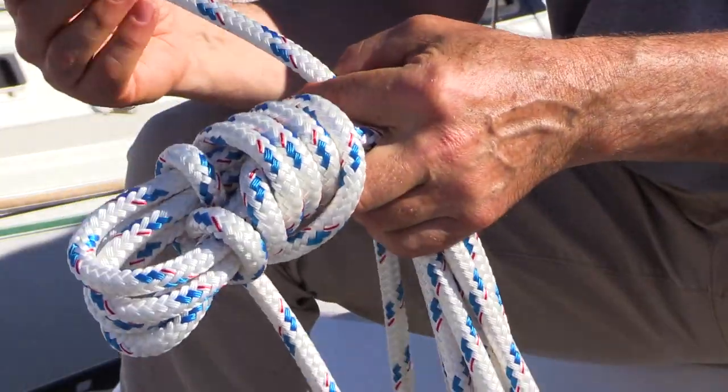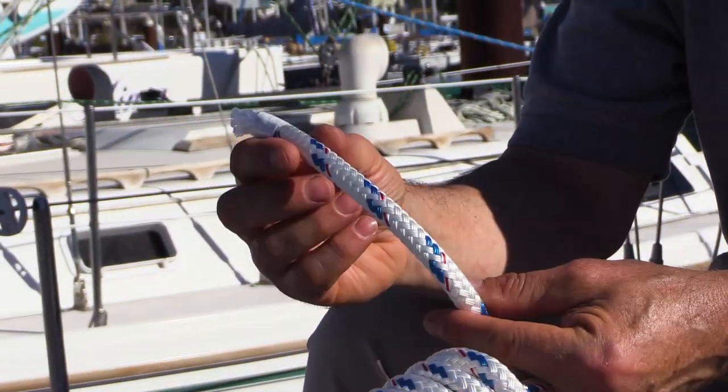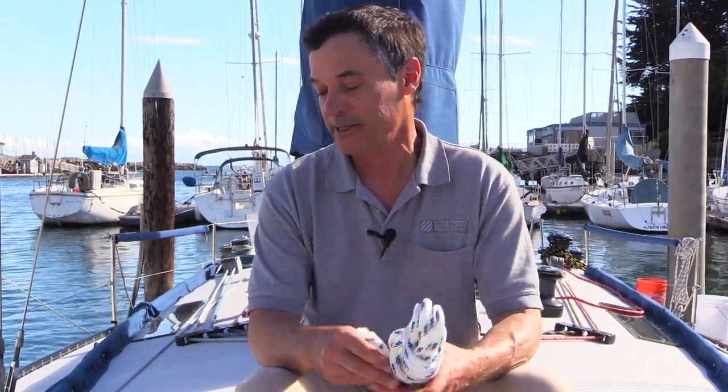If you've got a small boat, or actually any boat, you can use a double braid polyester. This is a Stay Set from New England Ropes, and it is used for most everything on boats. Can be used for a halyard, but it's somewhat stretchy for a halyard on a bigger boat. So if you're over 20 feet or so, you want to consider something a little lower stretch.